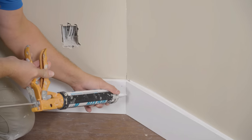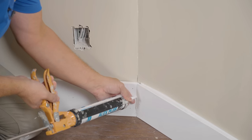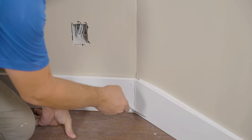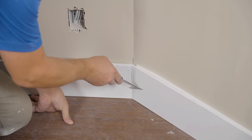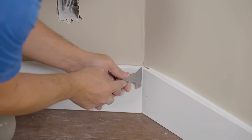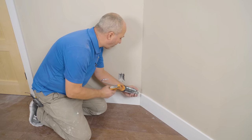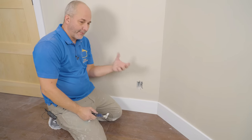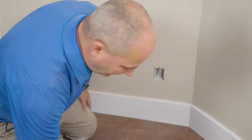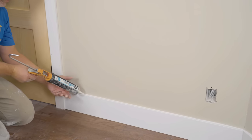Because I use adhesive and nails here, this is not moving. Now I can caulk this gap here in pretty much the same manner — keep the tip away from the edge. Come over here on the bottom, run it across, make a nice little 45 with my tool, then run up the inside corner. Place my tool here and clean that out, then come across the top, cleaning all the imperfections and the difference in heights. When you're dealing with MDF as a baseboard, they come out of the mill at different thicknesses, so your corners are always going to be atrocious. Having a tool to flatten out those adjustments is money in the bank.